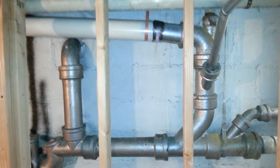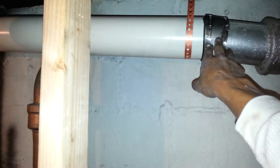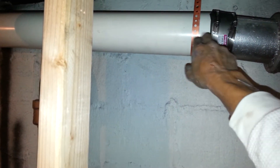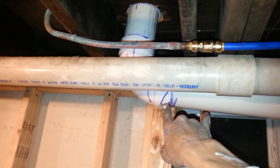Let me take you downstairs real quick and show you what's down there. As I told you earlier, I had to reposition a four-inch pipe — had to cut the existing pipe and run it an additional length. Here's what we have: this is the four-inch pipe I connected with a no-hub coupling along with a support strap, and it actually runs about nine and a half to ten feet. Here's another support strap.